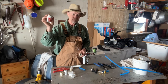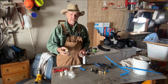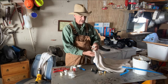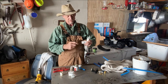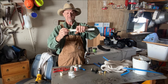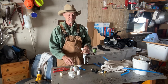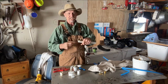You have to have glue. This is a multi-purpose cement — that's what I always get. Some say you gotta have cleaner. You open it, clean your pipe, take a rag, dry the cleaner off, put your glue on the pipe, put some glue inside your fitting, and shove them together. Make sure they're shoved all the way down. I always give a little twist when I do it. If you just got glue, you can put a little glue around that pipe, wipe it back off with a rag, and it'll clean that pipe just like the cleaner.